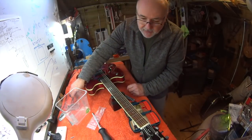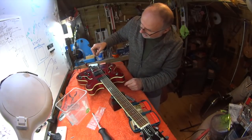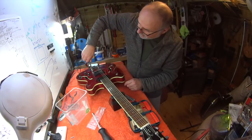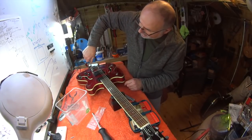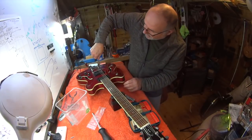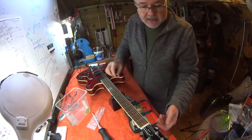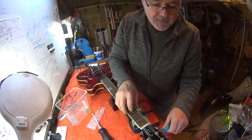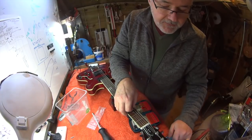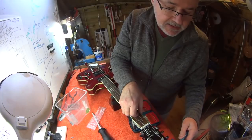Okay, so before we go any further, it's kind of important now to check, can I get any decent adjustment out of this without it tightening up? Yeah, see, that now becomes tight at that point, and that's too high down there. So I think we realistically need to give it a bit more wiggle room, which means going one size bigger on the drill. It's only a 0.5 millimeter size difference.